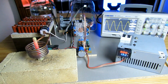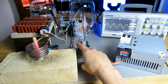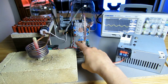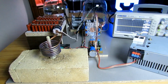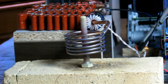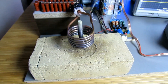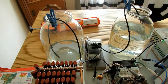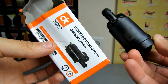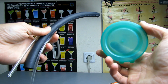In the first seconds everything worked perfectly, until the cooling system made itself felt. The pressure generated by the pump was insufficient to pump the required amount of fluid. At some point the temperature reached 300 degrees and the solder connecting the tubes began to melt — boiling water immediately began to spray in all directions. Luckily, I managed to turn off the power to the bridge in time. When checking, it turned out that the compressor is able to pump only two liters of water per hour — a complete failure. It was decided to replace the printer pump with a motor from the window washer of a Soviet automobile.